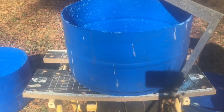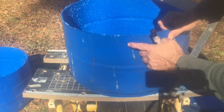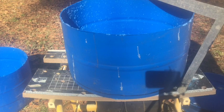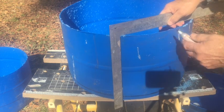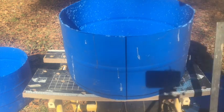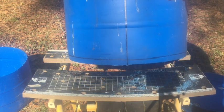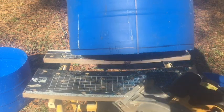Let's go back to work on our ring. The drum has a mark where a vertical seam is — if yours doesn't have one, take a framing square, put it on the drum, draw a line, and that's where you're going to cut it to make one big ring. Let me go ahead and do that.